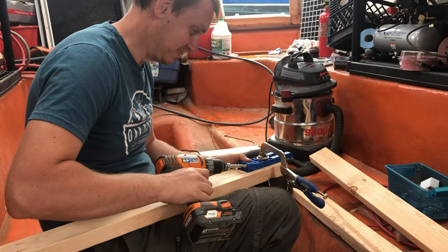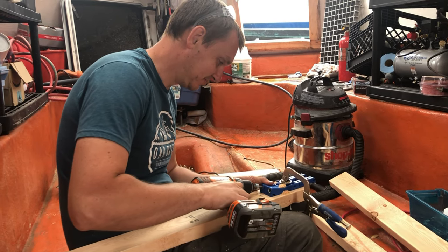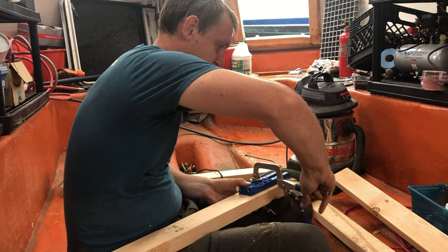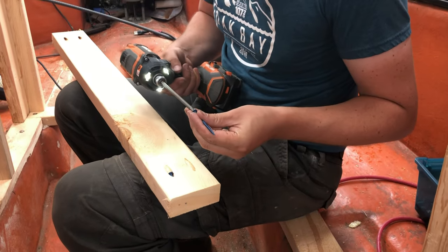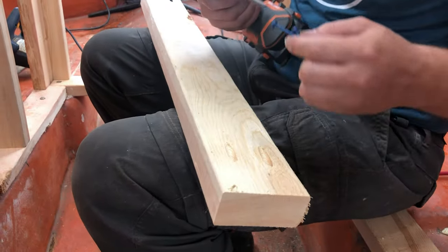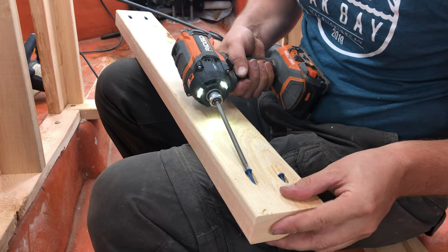It's so nice that we can use wood, tile, those finishes that we like, but also really feel like she is a solid boat — her hull is very solid, with tons of fiberglass in this boat. Torrin's using the Pocket Hole Jig by Kreg. We really like this system — it has these little angled holes that you pre-drill, then the screws go through there. Really handy for attaching bits and pieces together without having to make fancy angled joints or dovetail them. For this initial rough construction, combined with some glue, it's really quick, solid, and strong, so we use an awful lot of it.